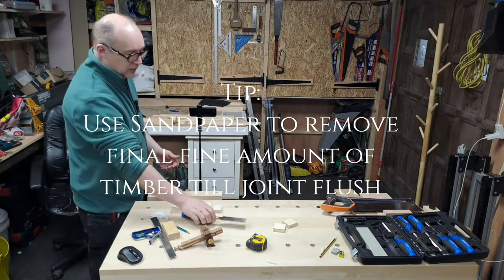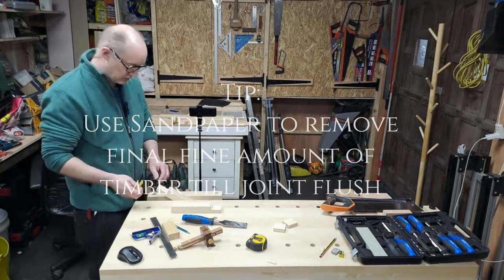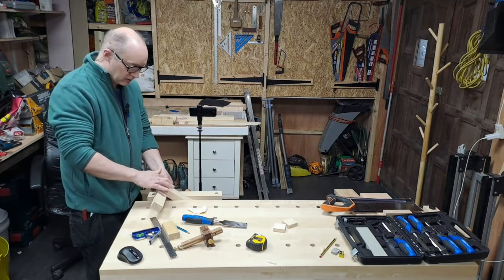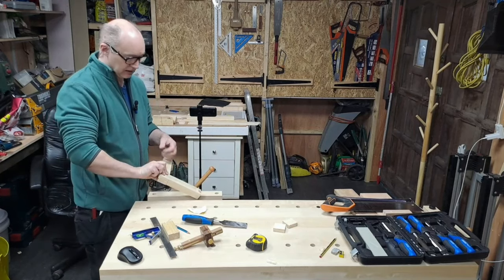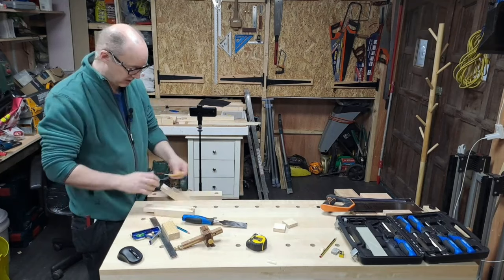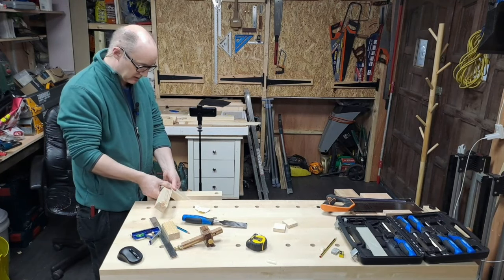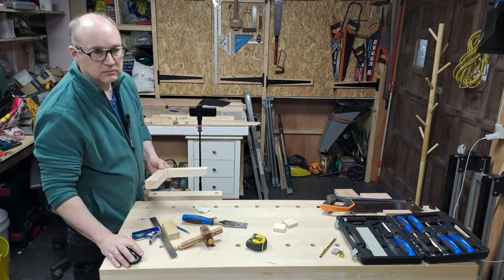Because we're using inexpensive tools, make use of everything you've got. If you've got a bit of sandpaper, don't say you can't use it. When you're very close and getting your faces flush, at that stage get out the sandpaper and get it down on that last bit to clean those pieces up. And that's quite flush now.